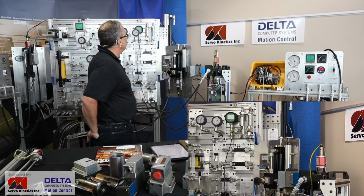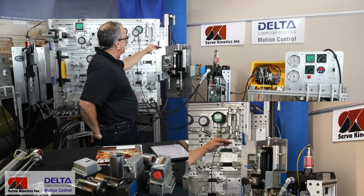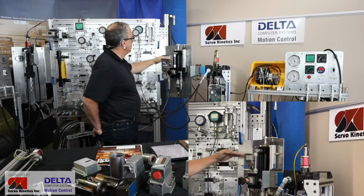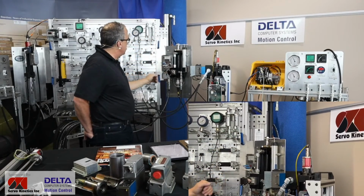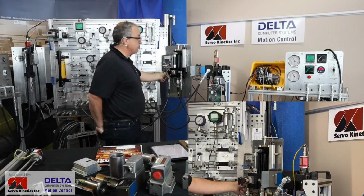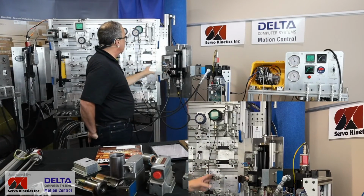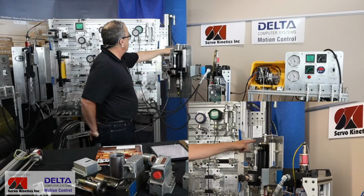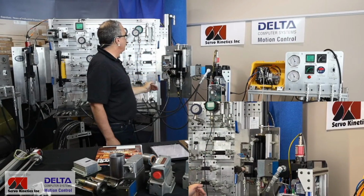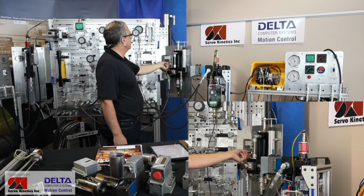Something's not quite right. And that means we need to do a little bit more tuning. That cylinder is continuously finding the target position and is then overshooting and passing back under it. It's having a tough time settling in, and that is perhaps because our proportional gain is set a little too high. It's a screwdriver and oscilloscope tuning for this one. We're not going to jump into that procedure with what limited time we've got, but suffice it to say, in order to get the cylinder to be very responsive, but then stop and settle at our desired target position requires some fairly careful tuning.